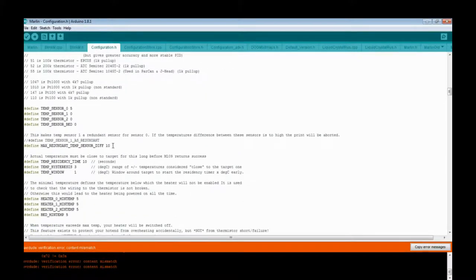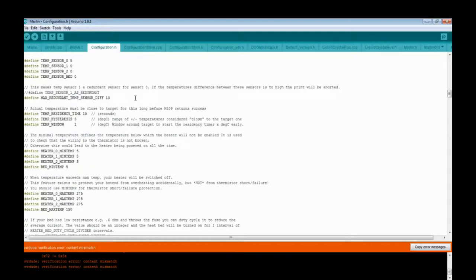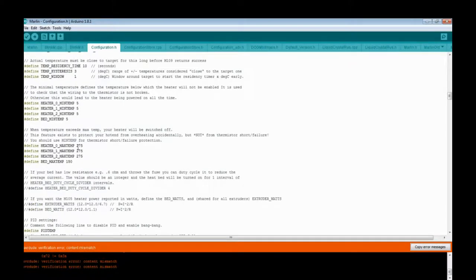Moving on, these are specific settings. Don't touch them if you don't know what they're doing. Doesn't really matter. The max temp, you might want to set to 245 if you have the E3D or the J head knockoff with the Teflon tube that goes the whole way down to the heat block. That is the E3D light. It's also preferred for the J heads because their machining is not as fine, and that takes a lot of the burrs out of that whole area, makes it better to use. I didn't do that because I'm using my own brain to keep from doing it, but it's just a safety factor.